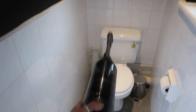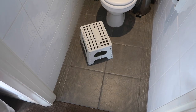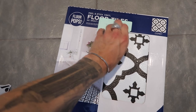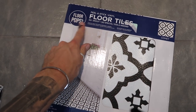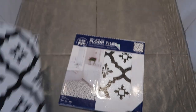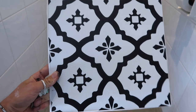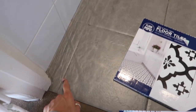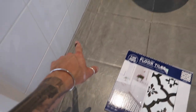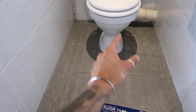The walls are all done. I finished off all the edging, made it nice and crisp and clean, and the little ledge is painted as well. Now I'm just going to grab the handheld vacuum and give the floor a good sweep, clear out, mop, and then pop the floor tiles down. These are the floor tiles we're using - they are from Dunelm. They're Floor Pops peel-and-stick vinyl floor tiles - I'll leave the link below. It's a pack of 10 and we measured it out, fingers crossed we'll have enough. We're starting on this edge and it should lay flat all the way along until we get to the loo and trim around it.